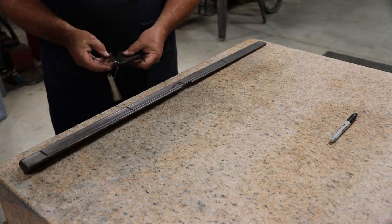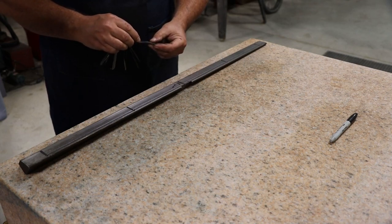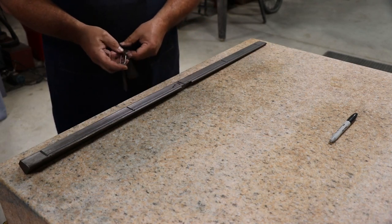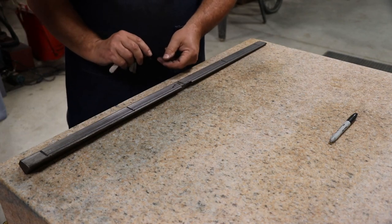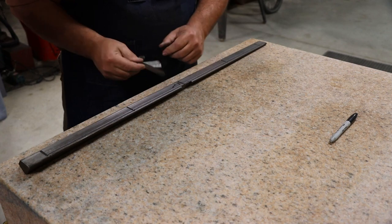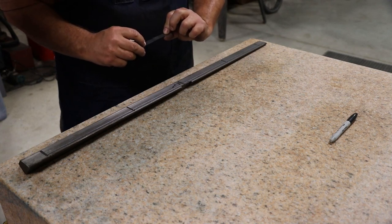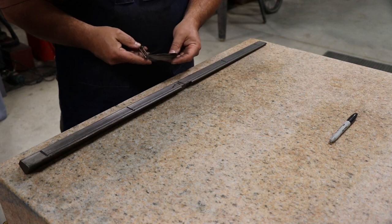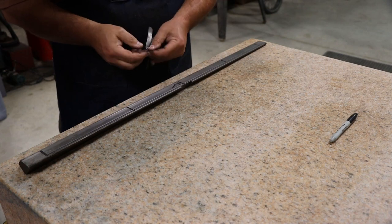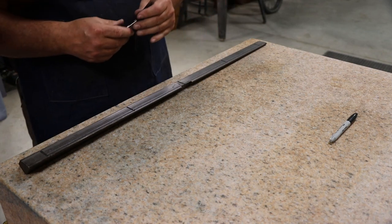Let's go down to something. 3 thou. Still tight. There it is. So I can get that 1.5 thou up underneath it, but barely. I don't see a 2 in here, but I do have a 3. That one there. That's not the 3. Saw it a minute ago. That's the 3 right there. And the 3 is touching. So we're probably where we need to be.